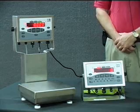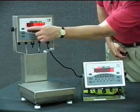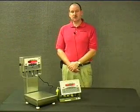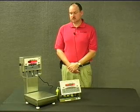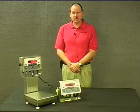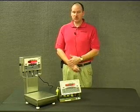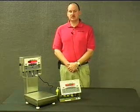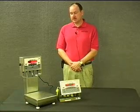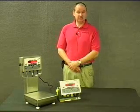The next set of jumpers is for configuration. On the other side of the keypad there's a menu button. Anytime that menu button is pressed with that jumper on, you could go through all the menu settings — audit trail, configuration, setup, and calibration. Of course in many instances you don't want all those menu settings available, so you would remove that jumper. Then when the operator presses the menu button, they would just be able to see the audit trail, the time and date, the brightness of the display, and exit.